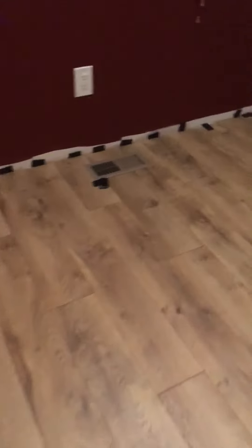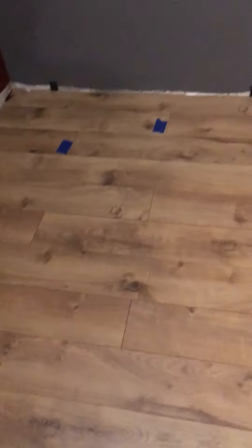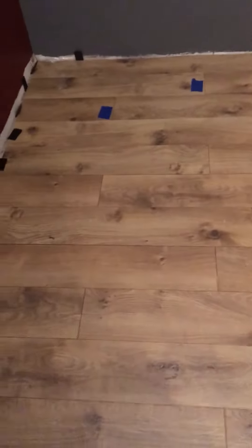Hello ladies and gentlemen, Dr. Benji Trash here. We're doing the Laminate Floor. Yes, you need the spacers around the sides because you're going to hit it with a hammer and set it. Blue tape is showing the coursing, very critical. Set those three up and fill in the blanks moving left to right. Just repeat that pattern and seal the straight lines.